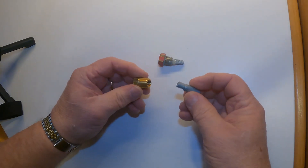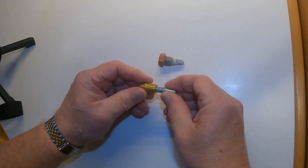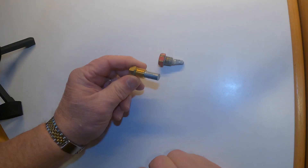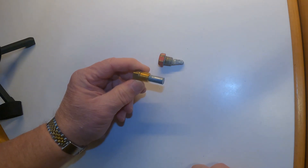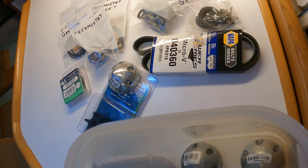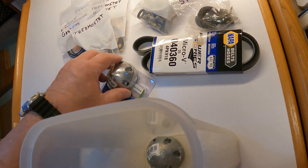The anode itself is not very big, and that is probably one of the disadvantages with this particular engine — this anode is rather small. Fortunately, it does a good job, but it is necessary to keep an eye on it and check it every few months. Having spare parts on board is just a necessity with a boat, and I have a container here that I keep my spare engine parts in.